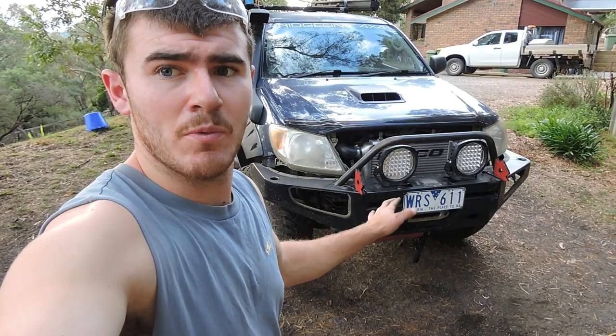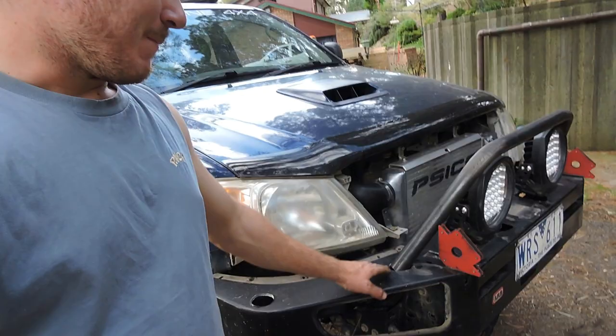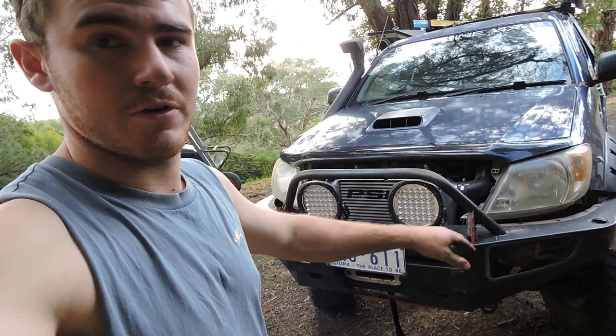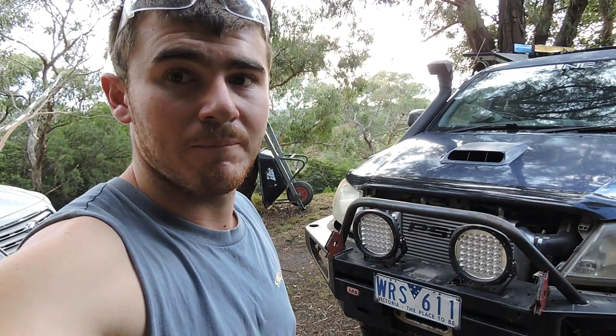It's been a little while and I finally have the new hoop on. It's not welded, it's just held up by those magnets. I even chucked the spotties in there to give us a bit of a look. I mucked up the pipe a little bit - I ended up cutting it off thinking I was going to put it through the bar about 40mm, but I ended up being flush, so that was my mistake. I just drilled a bigger hole and I'll just fill it full of weld on both sides. Basically I wanted to go through it because it's a lot stronger than just welding it to the top. If you don't want to drill a hole, you just cut it at the angle you want and weld it flat to the plate, but if you have it protruding through a bit it's a lot stronger. I'll weld the top and the bottom, and I'll probably put a cap on the bottom so I'm stopping water getting in there.